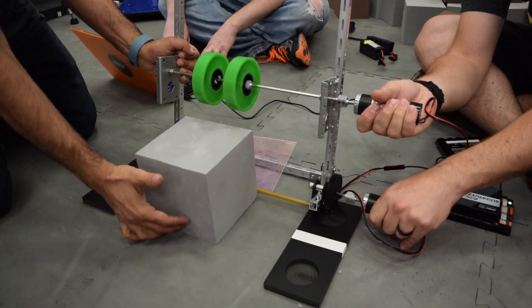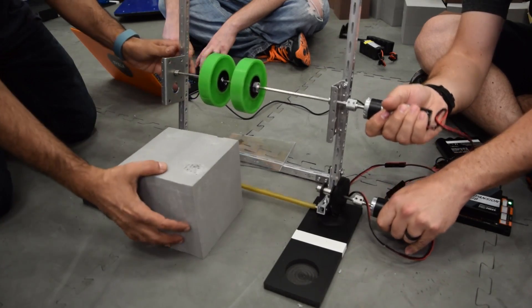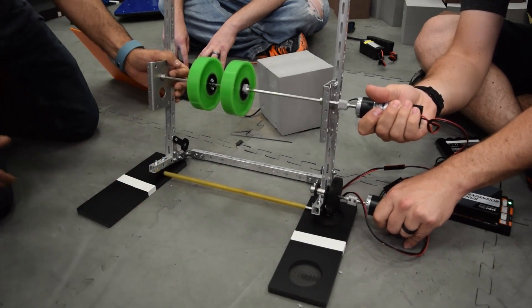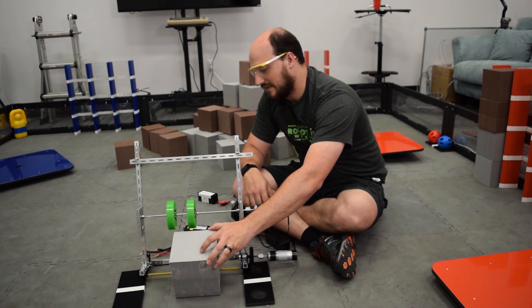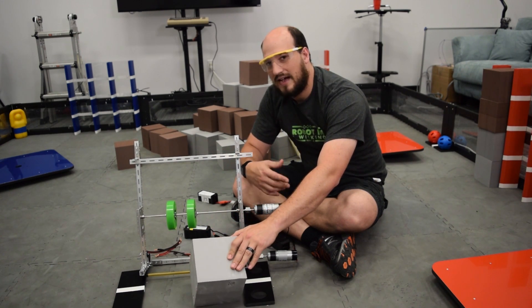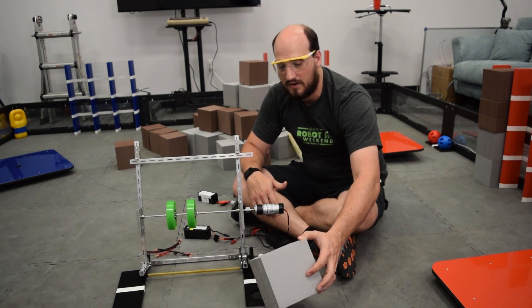In the second iteration, what we added is a bottom roller spinning at a high speed. The theory is it'll kick the front end of the glyph up before it goes in and then suck it through. It's a little wild — it works okay, but it's still kind of tumbling. We think adding some Lexan shields to control where the glyph goes once inside the mechanism might work.